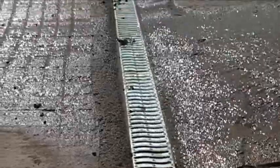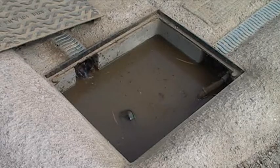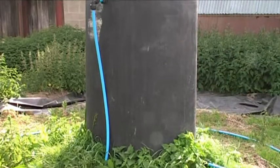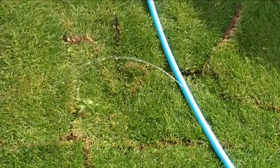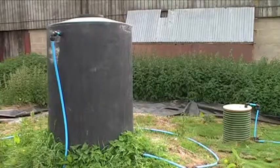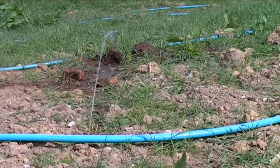Just explain what happens now. All the liquid we've collected from the biobed drains down through these drains into the sump here. It's then pumped out with a float switch into a holding tank on top of the biobed. The water comes from the holding tank in the bunded area and is then pumped into another big holding tank which then through gravity feeds these blue alkothene pipes. From that, the liquid goes through the biobed, filters and breaks down all the chemicals into another sump, and from there it goes onto a turfed, grassed area where it's irrigated as pretty clean water.